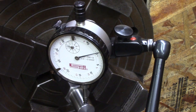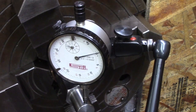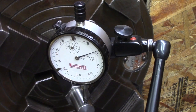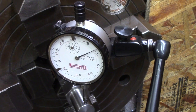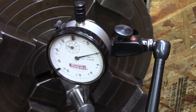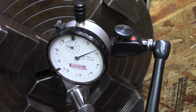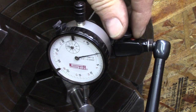I'm at half a thou, right on the line. Maybe a tenth under. Going right up to 3.5. 1.3, 1.4. Yeah, 1.3. So I'm getting a total of 1.3 minus 0.8. No, I'm getting about 1.2. 1.4 total deflection. I'm counting the notches, 1, 2. The point. Okay. I'm getting about total deflection of 1.4.